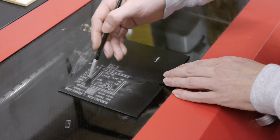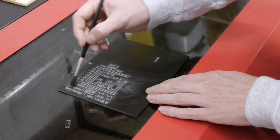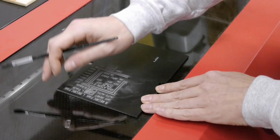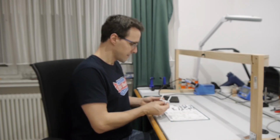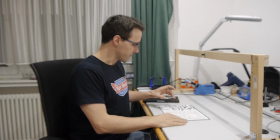All engraving came out clear. So I will clean this now a little bit, and then I can break them out. You can see they come out already here. And then we will see if it fits into the panel. And now comes the fun part of the project, a small puzzle game. I turn the white sheet around and then put in all the black parts from the back side and push them down until everything is flush here on the back side. I do this on a piece of paper to save the lacquer until it's covered with some clear varnish.